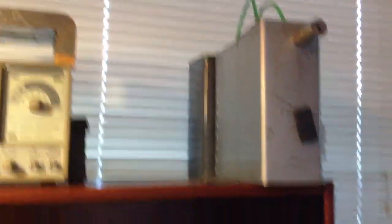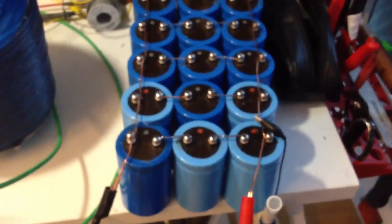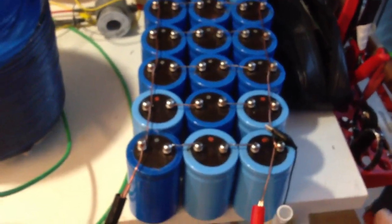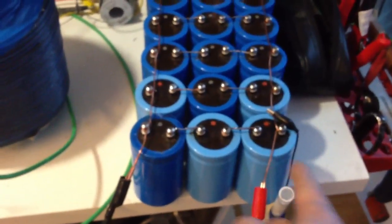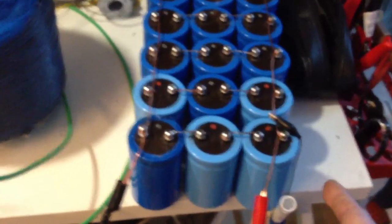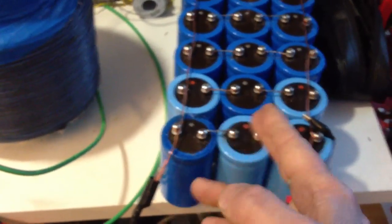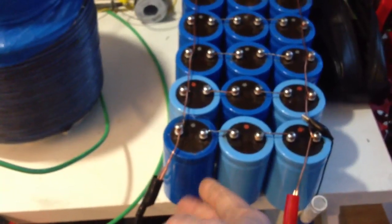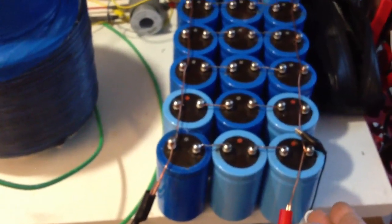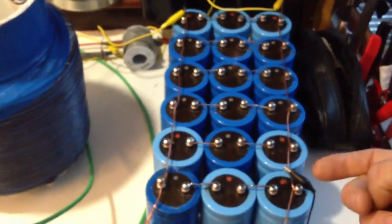You can use whatever size capacitors. These are some larger oil-can style ones, but I switched to electrolytics here. I have three 450-volt, 1,500-microfarad capacitors run in series, so three of those gives 1,350 volts. When you put them in series you lose capacitance, so it drops down to about 500 microfarads per row, and there are six rows, giving 3,000 microfarads.